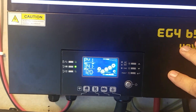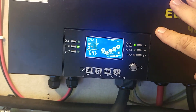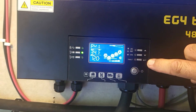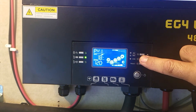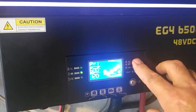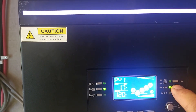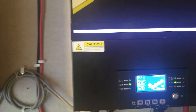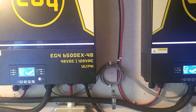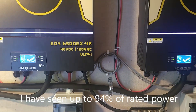Each inverter is running off 12 240-watt panels, so I've got 344 volts from that string right now. I've put this on a meter and never seen it go over 420, so I should be good there. I'm pulling in 1.7 amps and 612 watts. The other inverter is showing 354-355 volts, 1.7 amps, and 600 watts — so about 1,200 watts total right now off a possible 5,700 at full rating. The panels are used and probably around 85% efficiency, so that number is realistically about 15% lower.